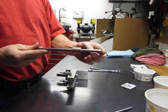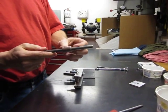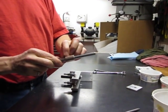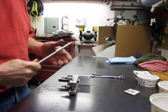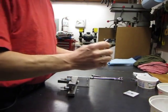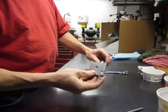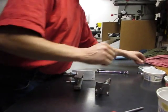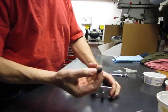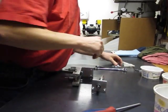Now for some business. This is the main shaft — this is another sintered bronze bearing. The release arm grabs hold of this. I've already mounted this on at the appropriate length, drilled the hole, and that's a spring roll pin that's been pushed through to keep this in place. To assemble this, I have a lock collar, my main spring that took me forever to find, then I slide on the rear plate. On the back of that I've used this wire grommet — it's my shock absorber to keep it from banging metal to metal, which you'll see how that works in a second.